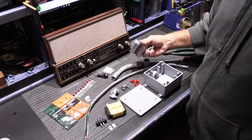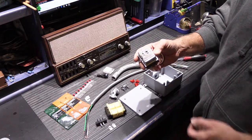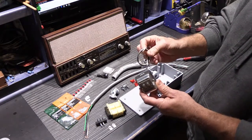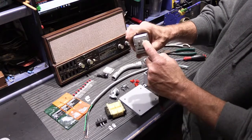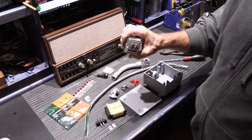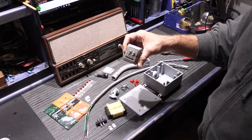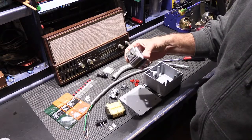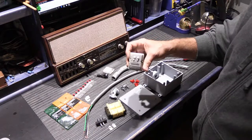This is a class 2 transformer, which means it's fully enclosed in a metal body. It has 110 wiring on the back and is typically mounted to an electrical box, with wires running to the intercom master station. On systems like the 2540 and 2090, the transformers are mounted remotely, typically in a utility area like a garage, basement, or near the furnace or water heater — not in the walls behind the master station.